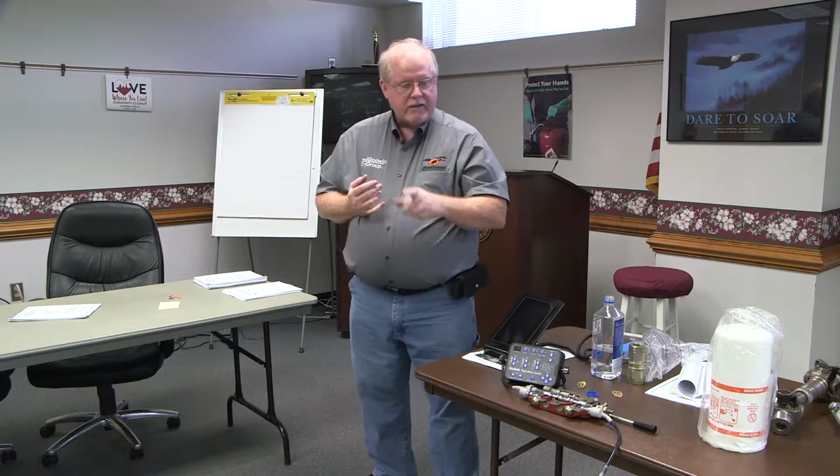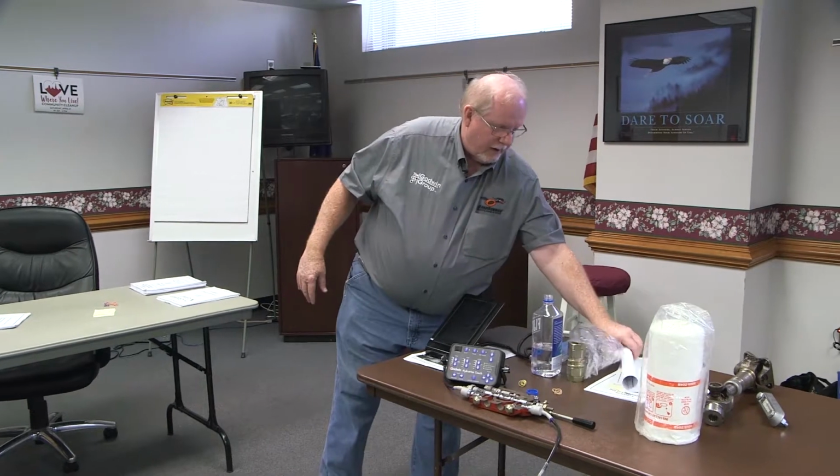The big difference is current draw. On the old trucks, the old dump body valve that used to sit on top, the big valve, that coil would draw 5 amps. Nowadays, the coils that we have draw 1/2 of 1 amp. That's all we're drawing. So we've got a very low current draw on our valving now, to help save on batteries and alternators, because you do have a lot of things with current draw now and some issues with that in the past.